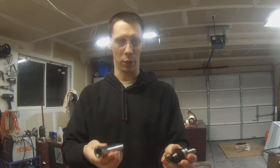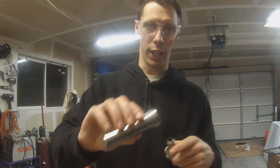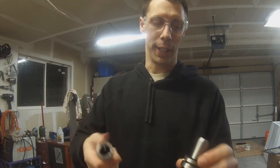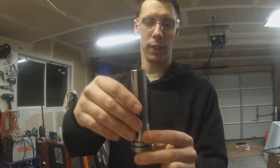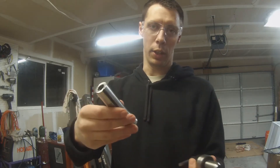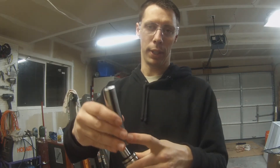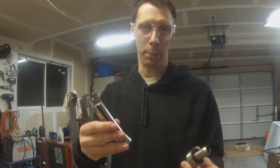I'm not sure how accurate I'm going to get — I've got a little angle finder and we'll try to get as close as we can. I also purchased into the Tormach Tooling System — TTS they call it. It's pretty simple: it's an R8 collet ground flat on top, and the tool holders have a recessed edge that fits against it. The idea is that when this goes into your R8 spindle, a normal collet seals at the tapered edge, but it seats a little higher or lower every time — it's not repeatable, so with CNC your tool table is worthless.